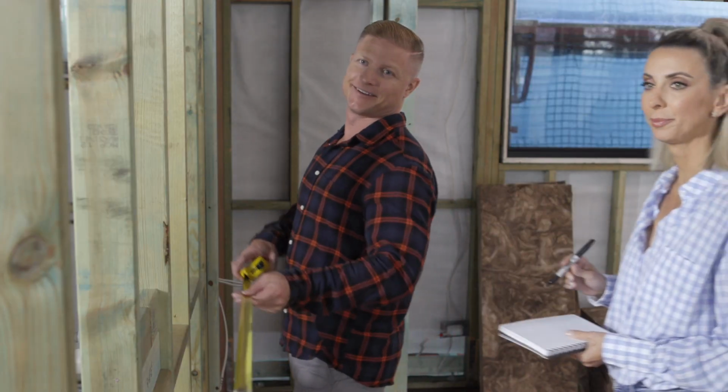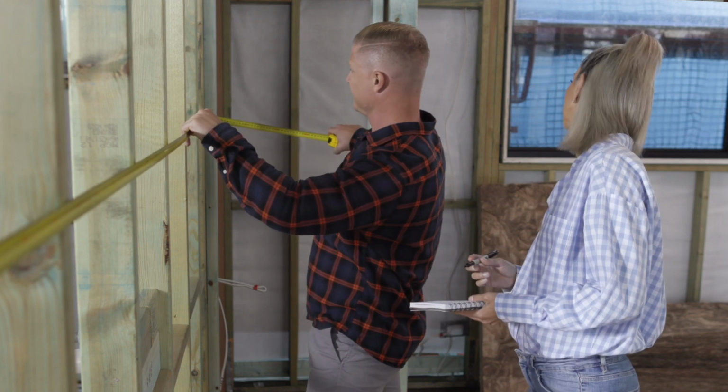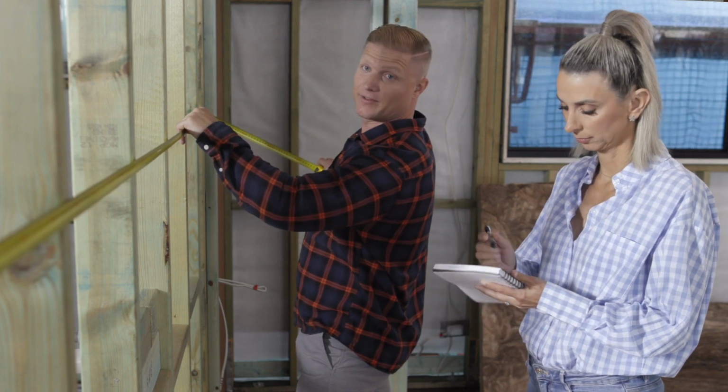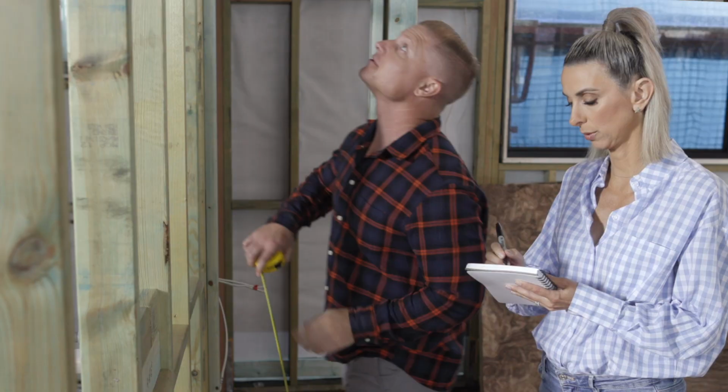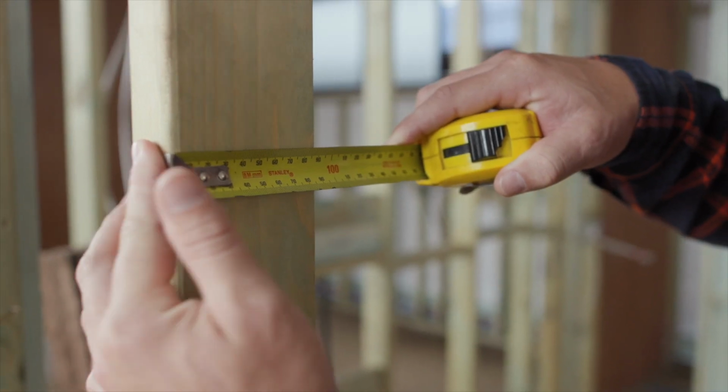Preparation begins with knowing what size framing you have. Most wall insulation is made to match the thickness of common timber and steel frames using 75, 90 or 140 mil. And the thicker the frame, the better the thermal insulation and the acoustic qualities. While that's pretty much the industry standard, Earthwool glasswool can be made denser for thinner wall frames to increase performance, which all revolves around the R rating.